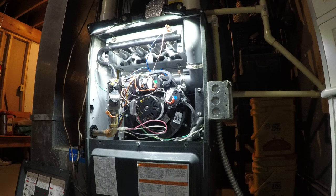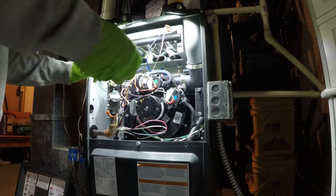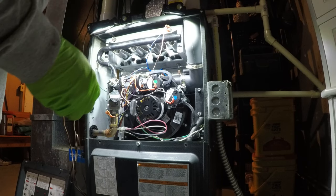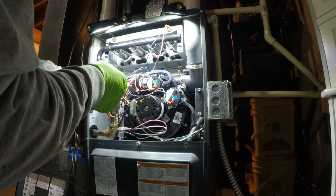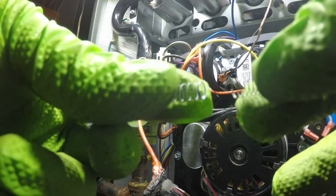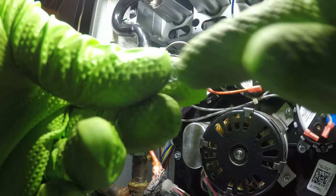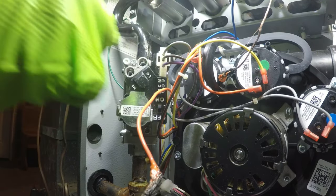So, before I forget, I need to convert this valve over. So, for those that you don't know, these valves are natural gas ready, but not LP. So, there's little springs in here. You can see the difference. This is lighter, and this is heavier duty. So when you dial in that screw, it's more pressure, less pressure for LP. So you gotta convert those two over.